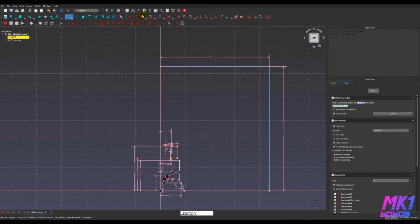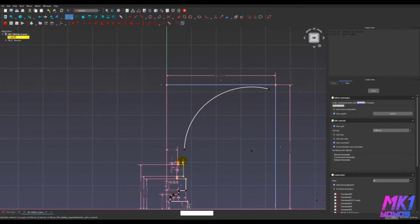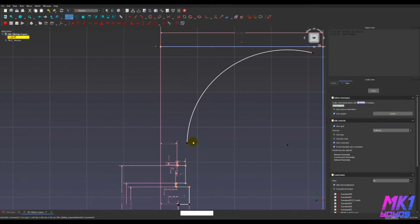So this is going to be an organic shape. I'm going to draw kind of like the major arc of the yo-yo here, something like that. And there's a couple things here that are going to be a little bit tricky to make them all connect. So there's going to be a smooth groove over here. And I already know from testing this ahead of time that this smooth groove is going to need to have some flat sections in the sketch to make it easier for the constraint solver to decide where everything should be placed.